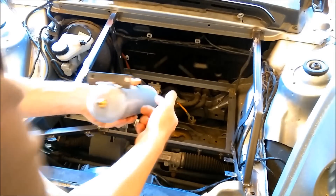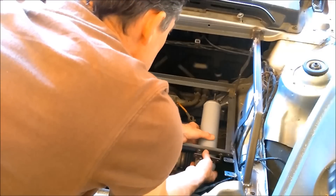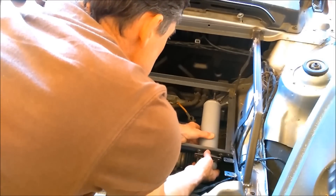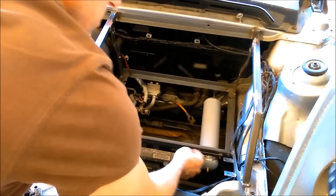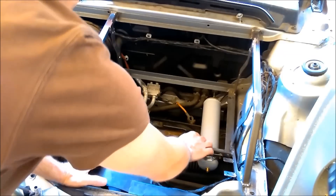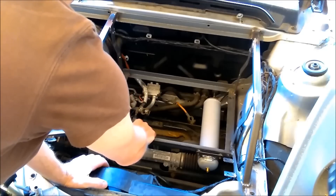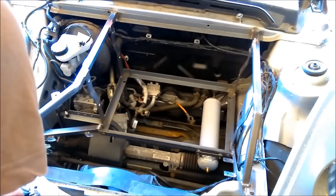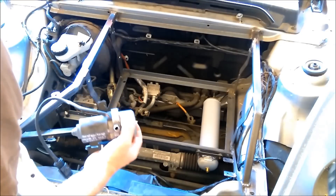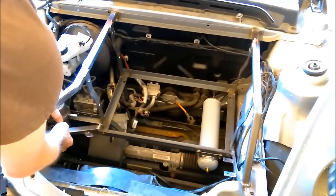In drilling this out the pin has dropped inside, but anyway I've made some mounts for that so it fits into a small grommet on the back as a pin, and I've got two bolt holes on the front so I can just put some nuts on there. It hangs in there using that space where the normal 12-volt battery goes. I'll probably just get a smaller 12-volt battery to replace this and take off the starter cable that I don't need. The vacuum pump - I've made some brackets on this frame and mounted it on the side.